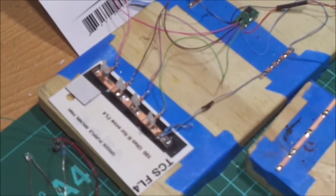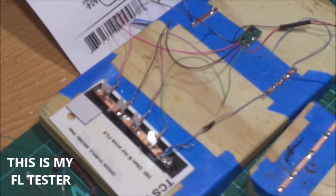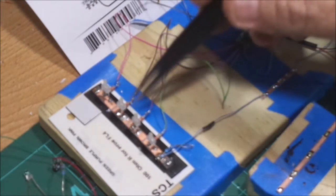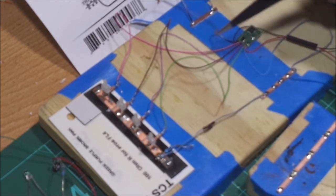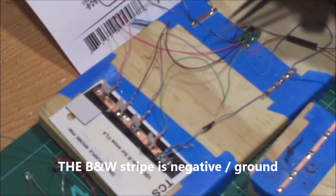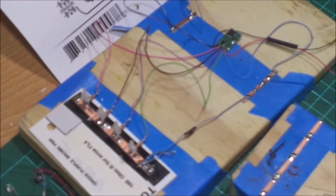Okay, let's come down here and look at what we've got. There's my testing leads — one, two, three, four. I'll turn those on and off. That's what I've done there using resistors to the leads. I always use the colored wire going off to the resistor and then to the lead, and the common blue which is the positive. Now the black and white is the negative. I'm using my NCE system.